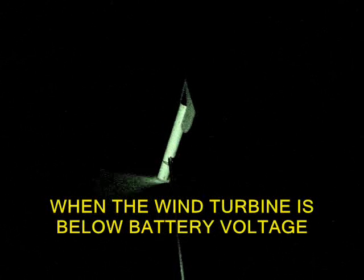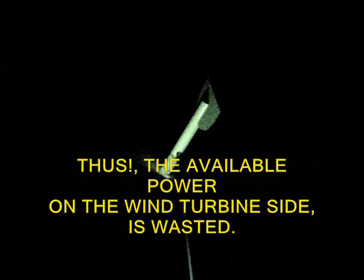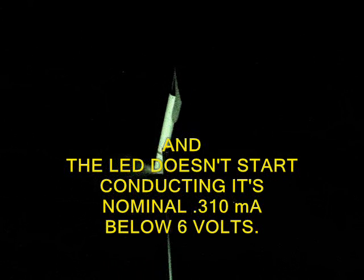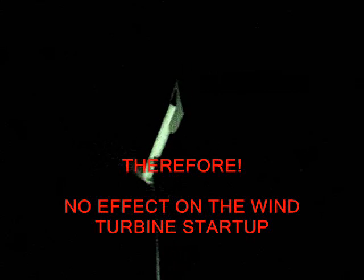I might go ahead and leave that light up on the roof. That's pretty good — if I can see it from the ground, it looks like I've got a nice big light on it, and I know I'm only kicking 3 watts, 310 milliamps. This is on the diode side — the wind turbine side of the diode — so it's really not affecting the charge going in. Less than one third of an amp, that's not bad — it's a drop in the bucket. The battery keeps the voltage down even going through the diode, so I imagine it sees at top maybe 14 volts. I believe it's weatherproof. I might put a sign on the tail — make the tail a little bigger and put Green Wind and other home energies on it for a little advertising.